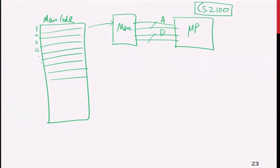While I'm executing this code inside your processor, I'm decoding it, executing it through the ALU and all this stuff, doing all the processing. In between, suddenly, bump, there's an interrupt request. Why? Because somebody goes and presses your switch. And this switch is actually connected to where?